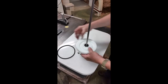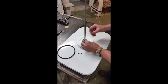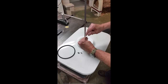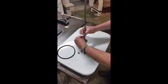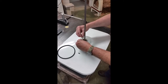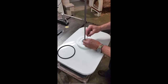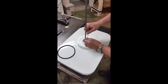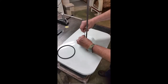To hold this all together I've got a washer, and I drilled out and tapped the UHMW for number six screws. The threads in UHMW aren't all that robust, but it doesn't have to hold much — basically just keeping the bearing from falling out, which it really doesn't want to do once it gets in there with the o-ring. You don't want to torque on these UHMW threads much because they will strip out. Just snug it all down.